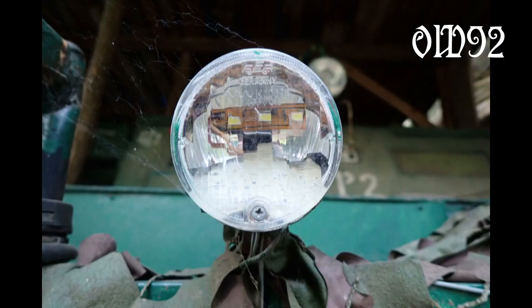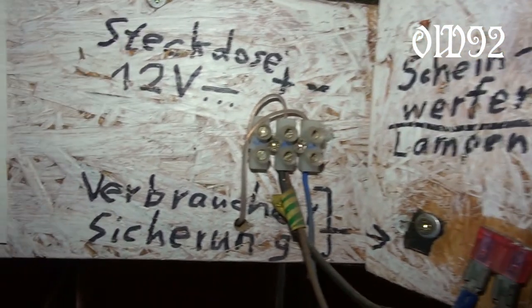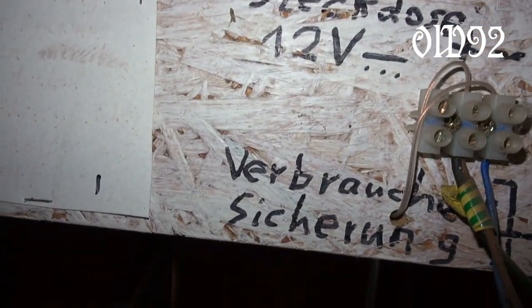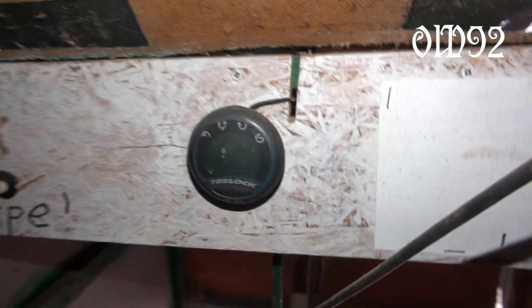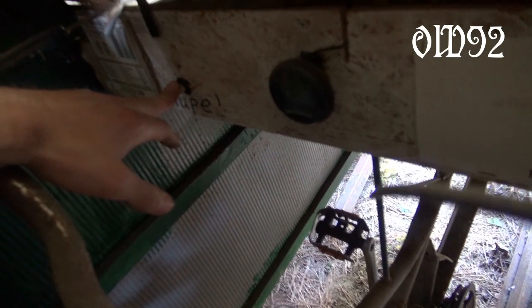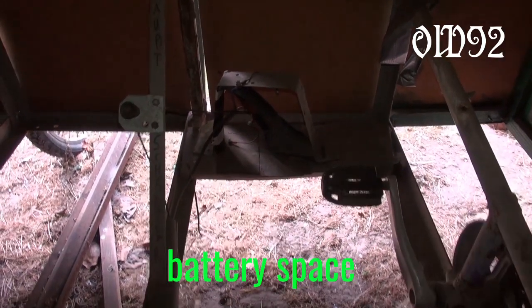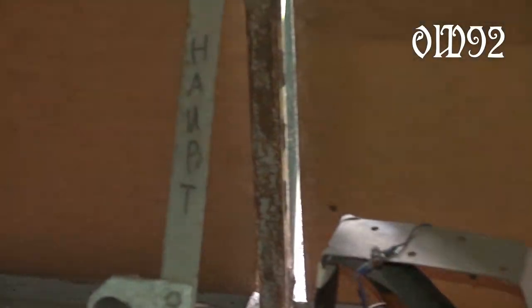For the front and rear lighting I use three LEDs on a sticky tape for each lamp. On board you can find a complete 12-volt system with a battery and the opportunity to charge it with a loading system that consists of a charging control unit and four dynamos. The horn is just a spare part that makes awesome noises when energized with voltage.